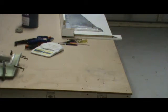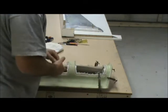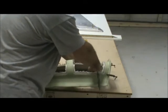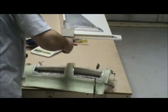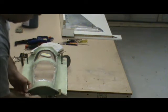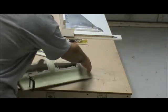All right, sorry about that — welcome back. So now we get started taking this canopy mold apart. Just a little bit of extra precaution to make sure that the flange on the bottom stays flat — I'll just put some clothespins down there to kind of pin it down. Pull all these clamps off, which I'll eventually replace with nuts and bolts — probably captive nuts on the back side of the mold and then just a quarter-twenty bolt or something going through it.